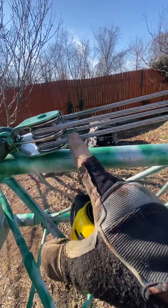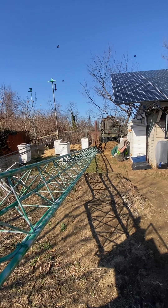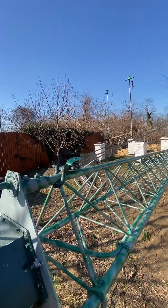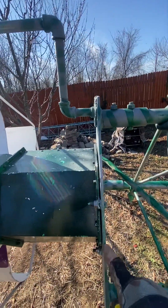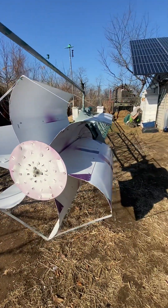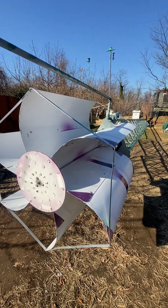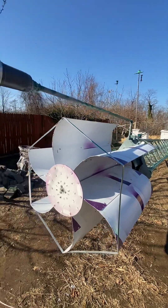The dual pulley is doing its job pulling it up — doesn't look stressed or bent anywhere. Each tower section is 105 pounds, so three sections is 315 pounds. Plus the plate is probably another 20, so 335. Then the turbine itself — complete with bands — is 73.5 pounds, so roughly 74 pounds. Total: 315 plus 20 is 335, plus 75, so you're looking at roughly 400 to 405 pounds with everything, plus the weight of shackles and cables.